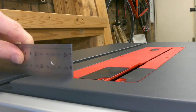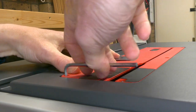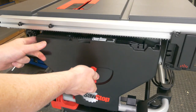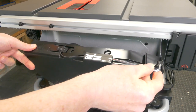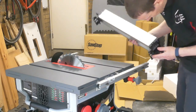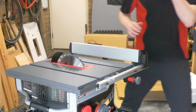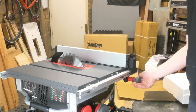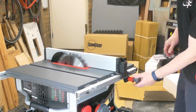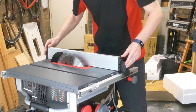You could cut straight away in this format, but I wanted to make sure it's tuned up. The first thing was leveling the zero clearance insert plate — it was already pretty good, but in a couple of spots I needed the onboard allen key for a few quarter turns until it was flush with the aluminium top. I figured out that the fence stows underneath for easy transport and has two separate positions to hook onto. It is super quick, locks down at both ends, rack and pinion style. The fine adjustment knob is very smooth — push in to lock, and there is no play. I found mine was perfectly parallel to the mitre slot and blade straight out of the box.